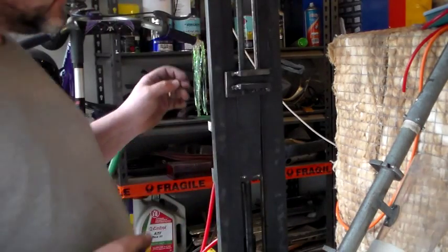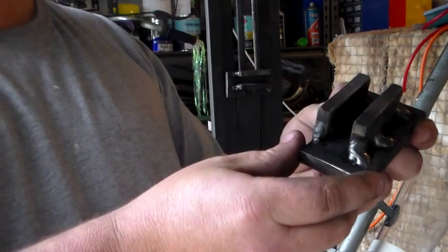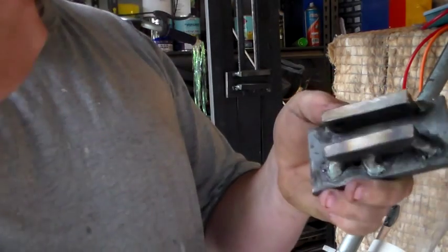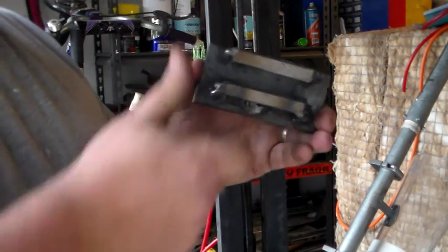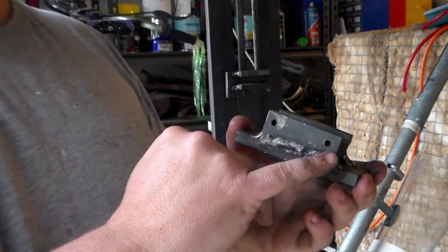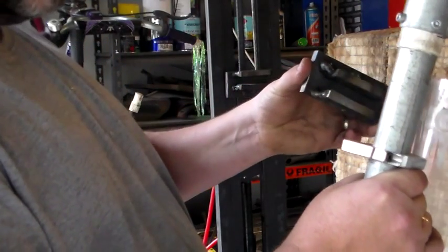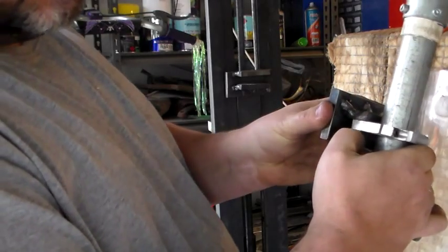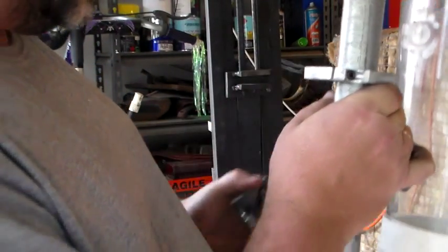So the way I decided to do this was I took the plates off — the top and the bottom I had on the front here — and I'll just show you what I ended up doing. I've welded two plates, just some 10mm plate, top and bottom. This one goes this way and the one on top faces that way, and the one underneath faces the other way. What I've done is drilled two holes in here which are tapped with an M5 thread. Once this is mounted on, that should be able to sit in there, and then I'll be able to put two screws either side that will just apply pressure to this plate — they don't actually go into the aluminium. They should just apply pressure and hold it there. We'll mount this all up and see how we go.